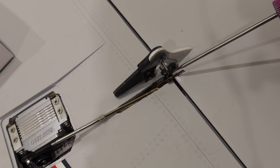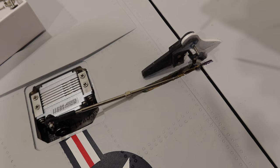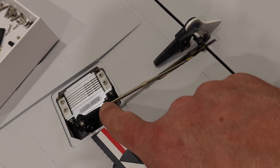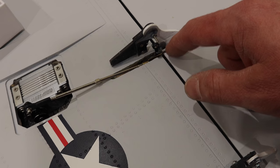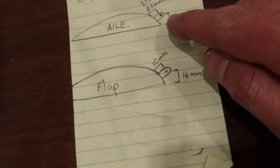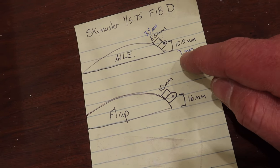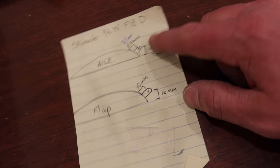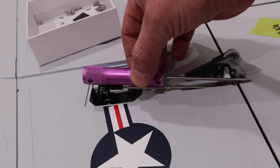The new dimensions I used on the carbon piece are actually a lot better. If we'd used the old dimensions, where that was closer to the top surface, this rod would have had to be at a steeper angle as I mentioned previously. So if you're building an F-18, the new dimensions I use are three and a half millimeters out from the surface to the hole and seven and a half millimeters up. I'm a lot happier with this setup — the big benefit is our angle doesn't have to be as steep.